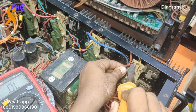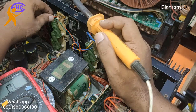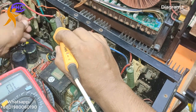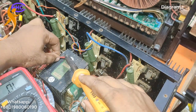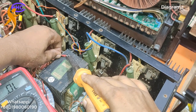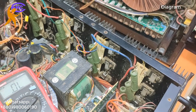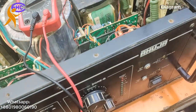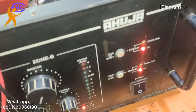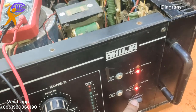I am fixing again. Let's check this side again — I am disconnecting the voltage from this side. Six transistors for one side. Look, that man could not solder nicely. Now I am going to check the power again. Look, now it's working! That means that side has the problem. The first six transistors are okay.